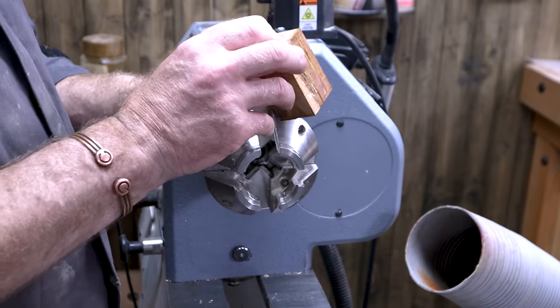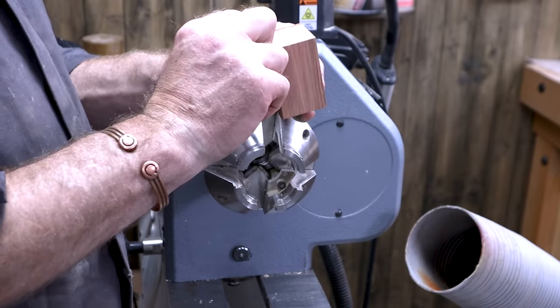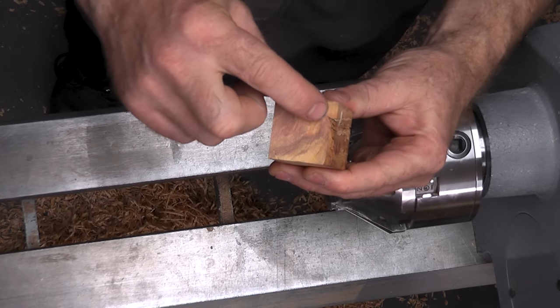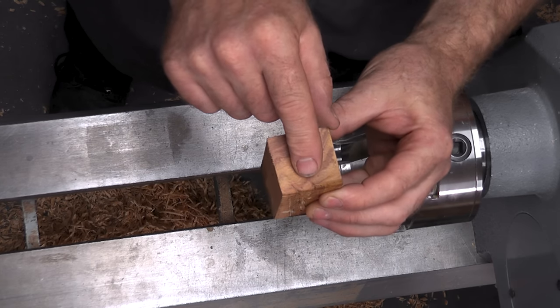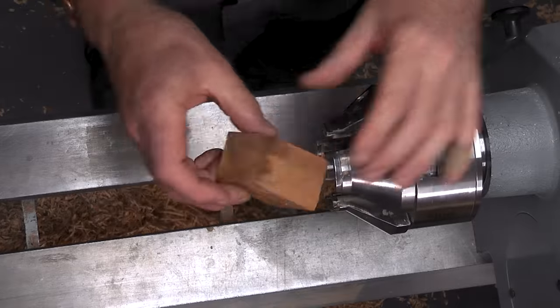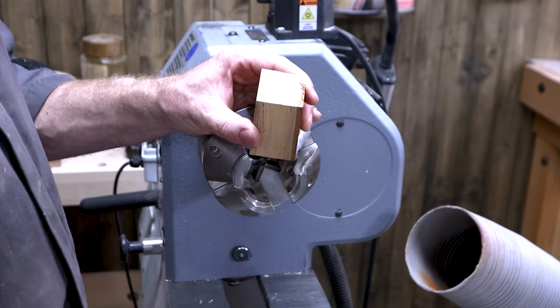First we've got to look at what we've got. I've got a little crack coming in from the sides here. A little bit on there. This will be better. All right, so we'll just come up there. A little bit of bark defect. Nothing much, but this has got a tiny hairline crack that comes in where it's dried and seasoned. That'll be better on the top of the bottle stopper. This will be the joining part where the stud's going. I've got to get this end clean, flat, and drill the hole.